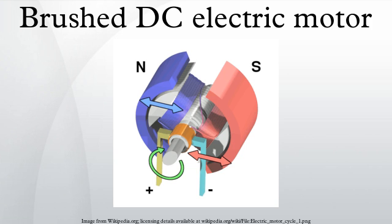Unlike the demonstration motor above, DC motors are commonly designed with more than two poles, are able to start from any position, and do not have any position where current can flow without producing electromotive power by passing through some coil. Many common small brushed DC motors used in toys and small consumer appliances, the simplest mass-produced DC motors to be found, have three-pole armatures. The brushes can now bridge two adjacent commutator segments without causing a short circuit.